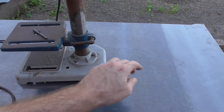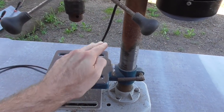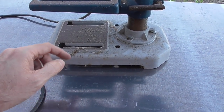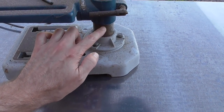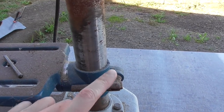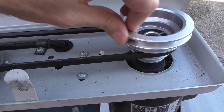These things probably have a proper name, but basically it's a drill press shortened a lot. The drill when it comes down is going to go through the floor, so we'll have to do some chopping. This piece will be thrown away, and I'll cut out that bit so we can go straight through. I think I can keep that foot. There are grub screws in here, so it'd be better to chop it at this end — it's also cleaner down here. Inside it's very clean and shiny — aluminium doesn't rust, I suppose.